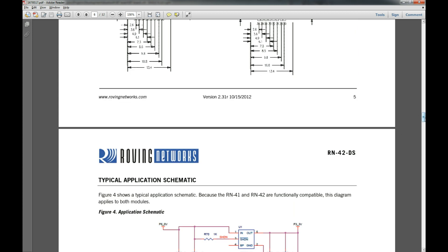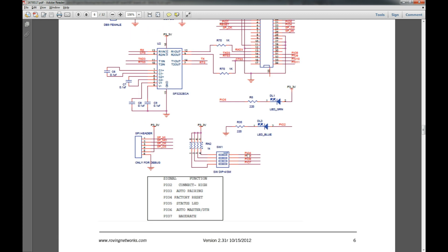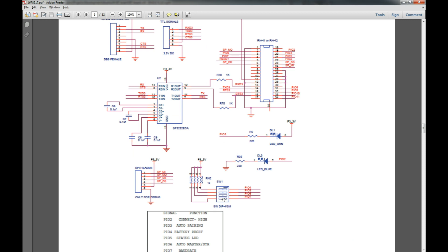That's really all those DIP switches can do — give you some different configurations. I say 'on the fly' but it's not really on the fly; you have to set them and then power cycle it and it'll come up with whatever settings you've set. But like I said, if you're designing a system you'd probably pick a specific mode of operation and just set them with resistors — pull up the ones you need and leave the others floating since they have internal weak pull-downs by default.